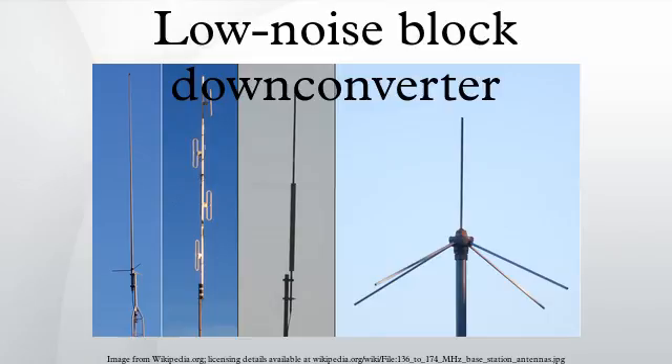The probe inside the LNB waveguide collects signals that are polarized in the same plane as the probe. To maximize the strength of the wanted signals, the probe is aligned with the polarization of the incoming signals. This is most simply achieved by adjusting the LNB's skew — its rotation about the waveguide axis. To remotely select between the two polarizations, and to compensate for inaccuracies of the skew angle, it used to be common to fit a polarizer in front of the LNB's waveguide mouth. This either rotates the incoming signal with an electromagnet around the waveguide or rotates an intermediate probe within the waveguide using a servo motor, but such adjustable skew polarizers are rarely used today.